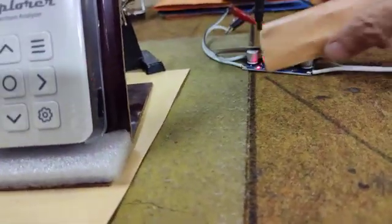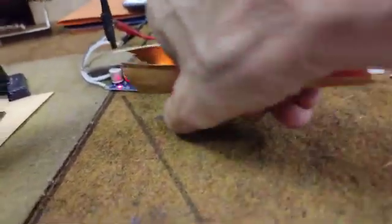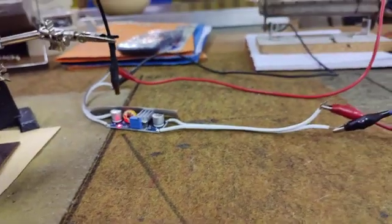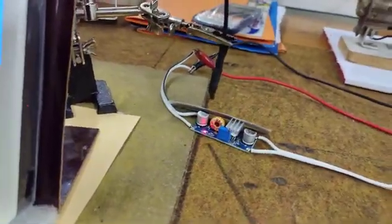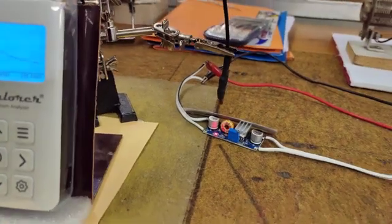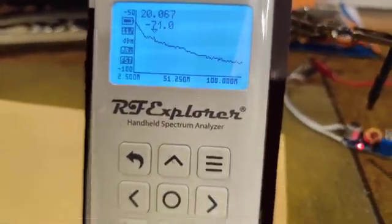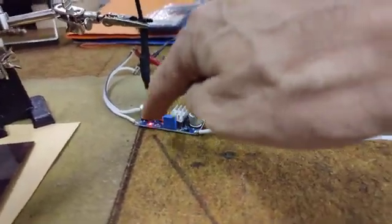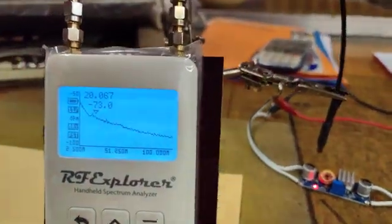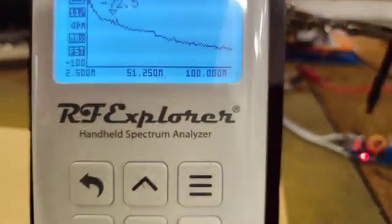Even if I make it tubular and slide this thing over and shield it 100%, this power supply and the probe, it will definitely go up to anywhere up to 20 dB attenuation. And 20 decibel attenuation gives you 100 times attenuation of the interfering signal. So I'll just quickly demonstrate that. With a quick power supply, we generate lots of noise, fed into a spectrum analyzer, and by putting the copper strip on top and an extra shield, you can definitely see that it attenuates by anything up to 100 times.